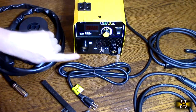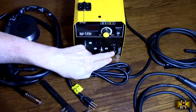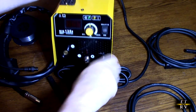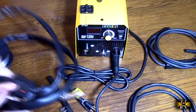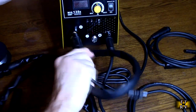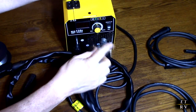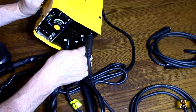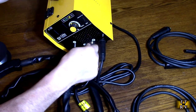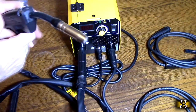When you want to do MIG welding, you're going to put your MIG welder tip in here and your control wires on that part right there. That's going to be the side with the ground. The way these connectors work is they actually rotate in — you line them up, they'll drop in, then go clockwise. For the MIG connection, the front part goes in, drops in, turns to the right and locks in place. Then the connector goes in one way — there are little tabs that allow it to feed in the correct way. Then you turn the screw and tighten that up.